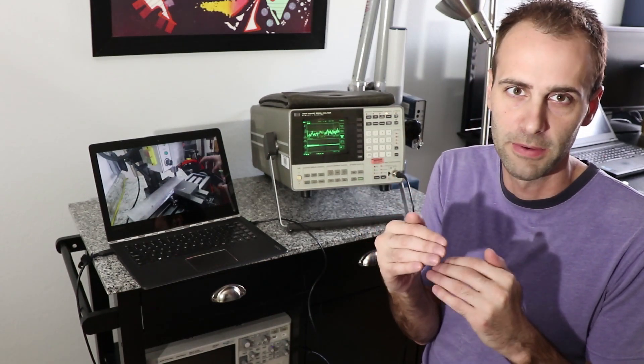The problem with this setup was that the two kilohertz squeal basically turned the audio signal into a two kilohertz square wave, filtering out a lot of the information we were trying to get. On top of that, the auto gain and frequency filtering in the camera microphones didn't do us any favors either. We're working with a tiny sliver of useful information buried in a very large noisy signal, so the signal-to-noise ratio was very low and it made the analysis very tough.